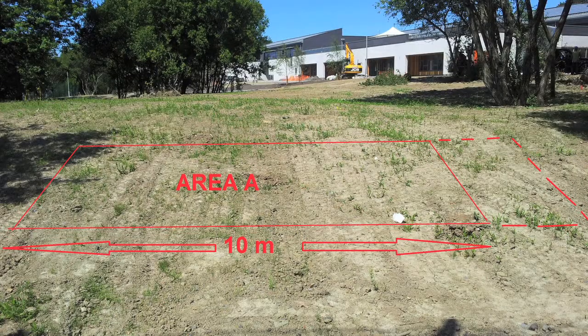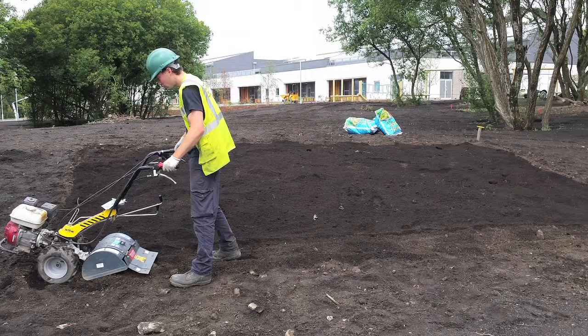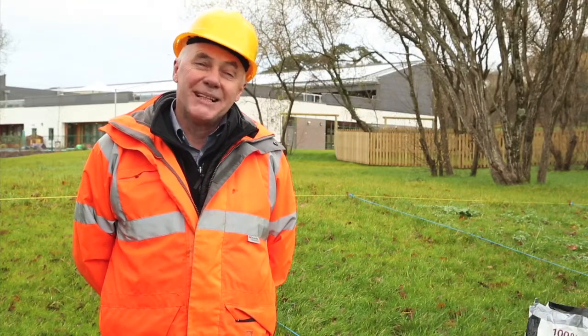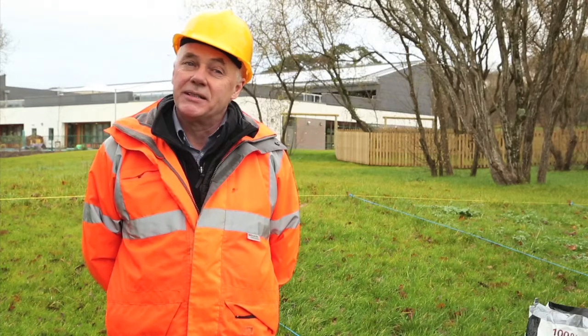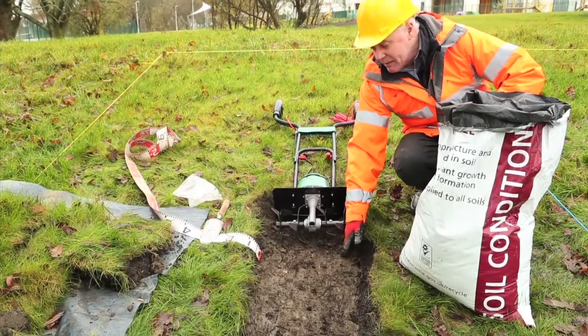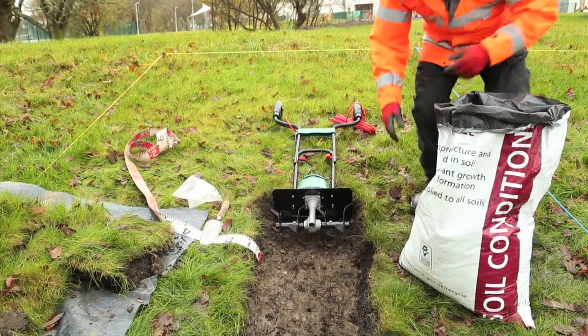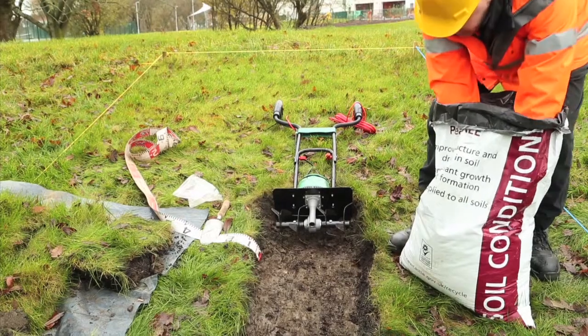The topsoil was manufactured on site by placing approximately 4 centimetres of compost on top of the bare soil surface, and this was then rotavated in with an appropriate sized rotavator to mix the soil typically to about 20 centimetres depth. So this is the surface typically a landscaper will have to work with when they start to manufacture soil. Onto that we will apply the compost.